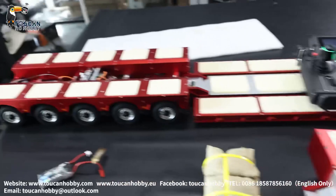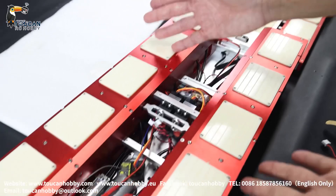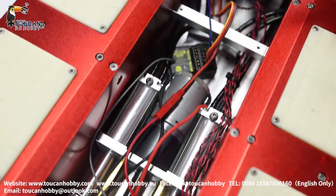So that's for the front three axles. For the rear side there are five axles, and we have the same system. For balancing and raising the suspension, it is also compressed by one motor with two cylinders inside. The perfect condition is maybe half oil and half air, so you can compress it when having a load while driving — so it will not be too hard and can be compressed.